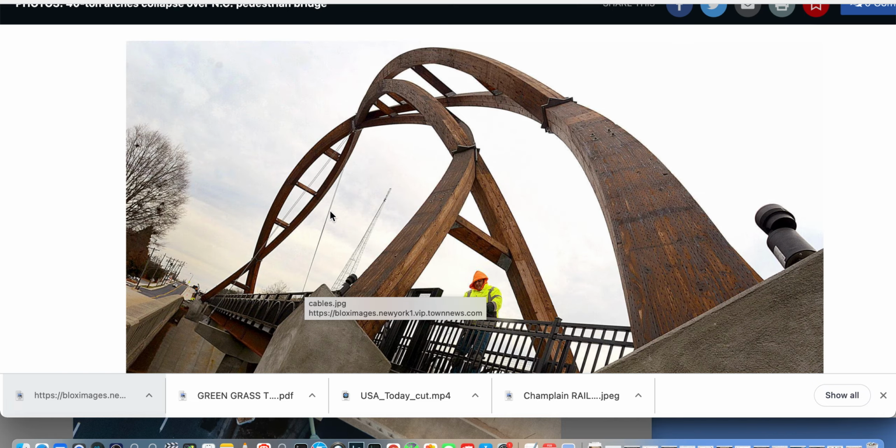Yeah, I can see where you're pulling down on one of these and you're not pulling down the other one. You only got one connection they're pulling on, and that's got to uniformly compress this into the abutments, both of them at the same time. And it's wood, so it has the capability of expanding and contracting. I don't know the stability of it, and then it's got these joints that it can also slide off of. Wow, this requires that this remain as you're pulling down. This wants to push it down into here, but it also wants to fold it in, so it also wants to do this.